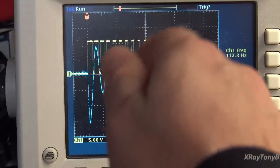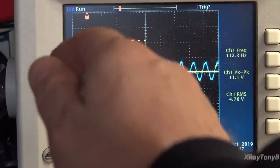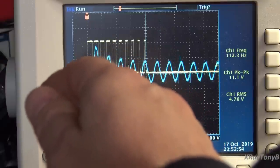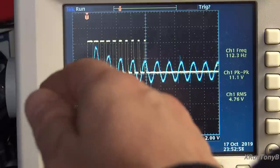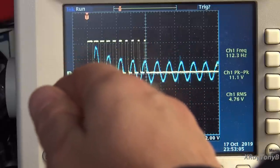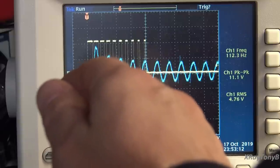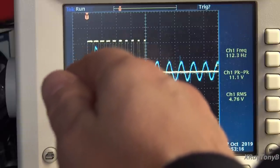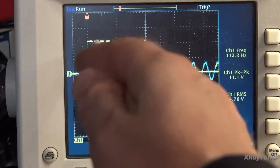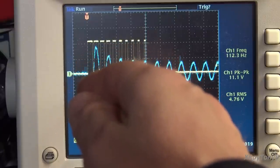Out to about this point, we're ignoring those pulses. In the first 80 milliseconds you can see how tiny that initial spike is. Notice the width of these pulses getting narrower — because this low-impedance condition has a much steeper rise time. For this first half cycle, which is about 8 milliseconds, the majority of the half cycle is in excess of that 1.8 amps. The next pulse is a little narrower because it's above 1.8 amps for a little less time, and so forth until just a tiny portion of the last half cycle exceeds the trip point.